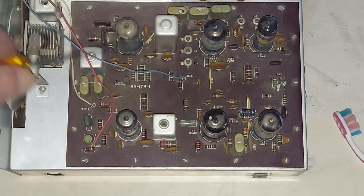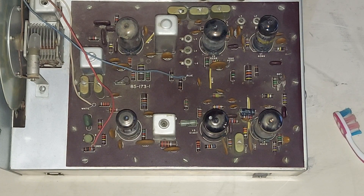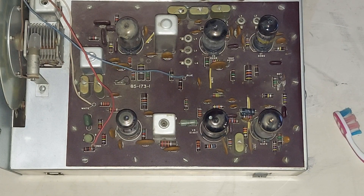Whilst this 3-watt resistor is very close. So what do you do? What about the ones that are right on the edge — do you replace them? Are they drifting? Because if they're right on the edge, you're going to drift out of tolerance any day now. The answer is yes. And if nearly all the resistors are near the tolerance edge, I guess you've got to replace them all.